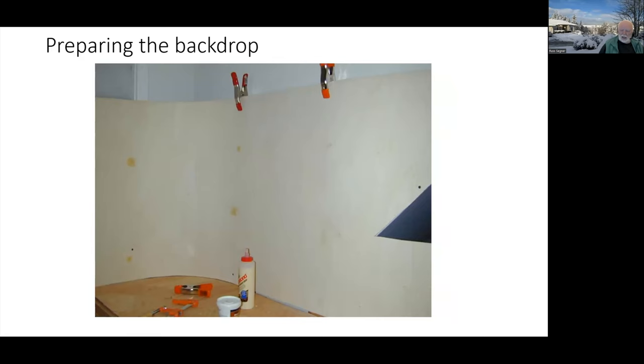It's an eighth of an inch thick, comes in 4x8 sheets, and it's bendable on either one of the two axes. It'll bend this way, or you can get it so that it bends the other way. In this case, it makes really nice tight radiuses. It's a genuine plywood, about five thicknesses or layers with no voids in it. And so it's incredibly smooth and in transition.